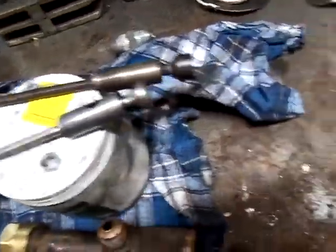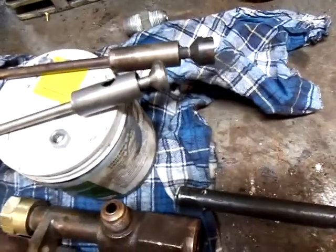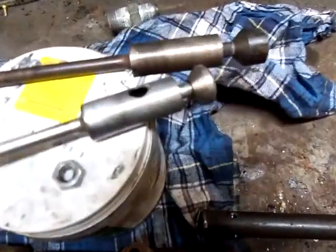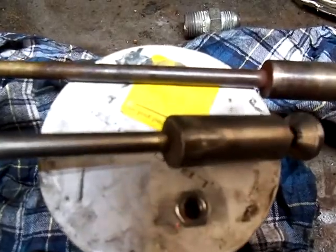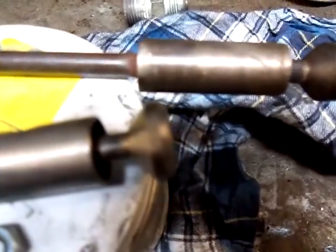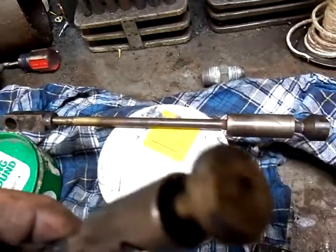This tool here — you've got to narrow that seat down. It threads and fits in that hole. There's a drum back in there, a hole where you have to machine that. You don't want that seat real wide. I silver solder my drums on — it's all stainless. I also pin it like they did originally. The poppet is threaded; I thread the whole way through and then I silver solder the end.